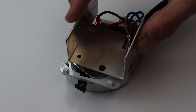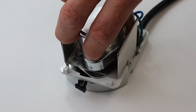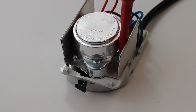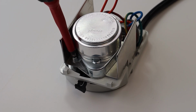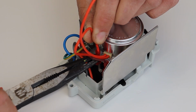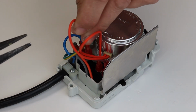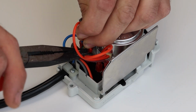First, position the heatsink so that the holes align and then insert the sprocket of the new motor through the larger hole so that the teeth mesh with the gear rack. Next, align the screws with the screw holes and tighten, making sure that the motor mounting plate and heatsink are aligned and secure. The two Rast connectors on the end of the new motor can now be connected to the terminals on the circuit board. Polarity doesn't matter, so the wires can connect to either terminals.